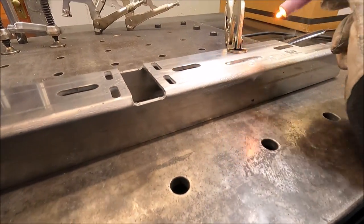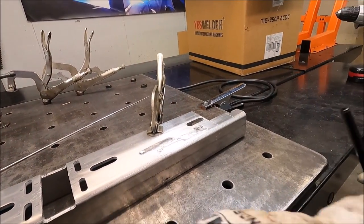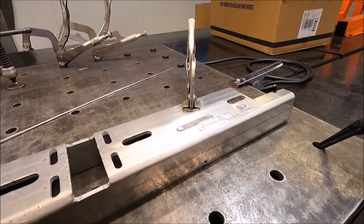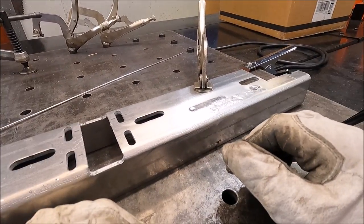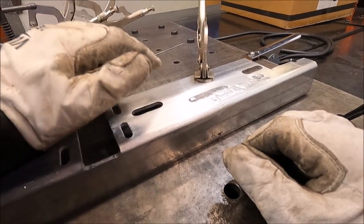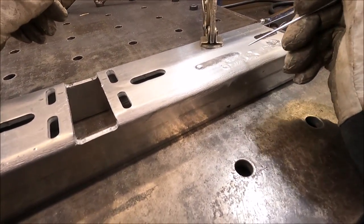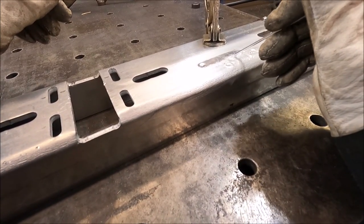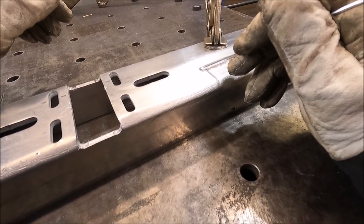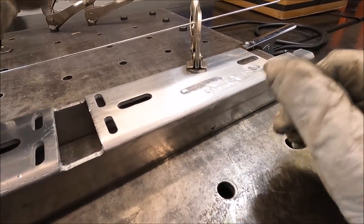I'm still working on getting that crater a little bit better towards the end. But this tells you it's been about 10 to 15 years since I've TIG welded aluminum, and literally out of the box you can get going with this. I've got to mess with the settings more and read more about this welder to try to fill that crater — I'm sure there's a setting or something I'm doing wrong. I think I need a different tungsten. But the weld right through here looks really good. I have a little bit of porosity — not sure if that's the tungsten balling up — but for the price this is just a decent welder to get set up welding aluminum.